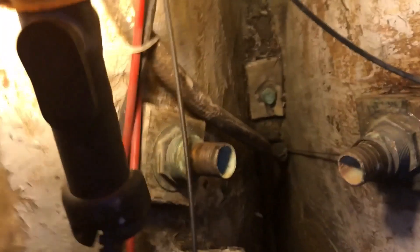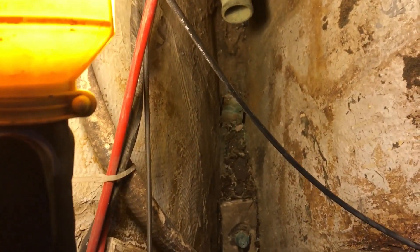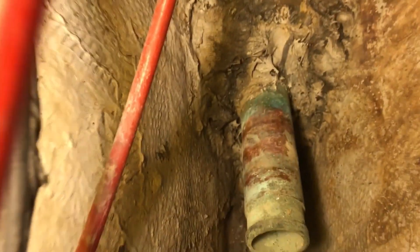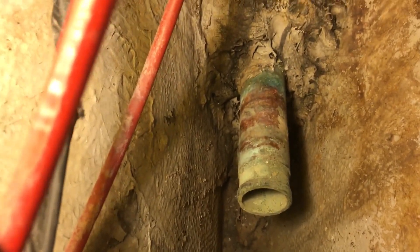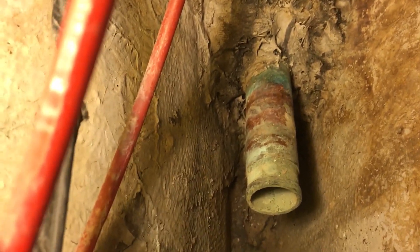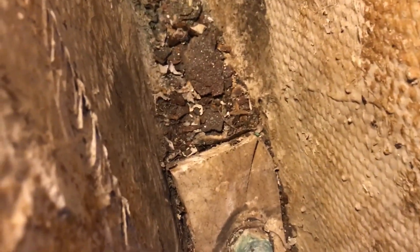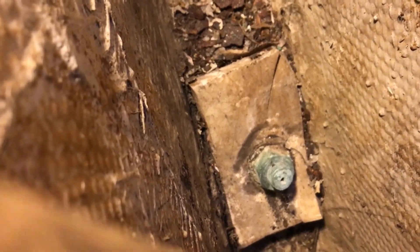Just like anything else, once I pulled out the driveshaft, I noticed that somebody did some shoddy glasswork here around the stern tube, presumably to address a leak. I hope there wasn't a crack there, although I suppose that's possible — highly unlikely. Also, this is where one of the attachments to the rudders is. You have this backing pad or backing block there that is really in bad shape.